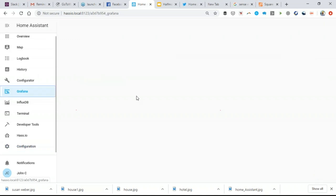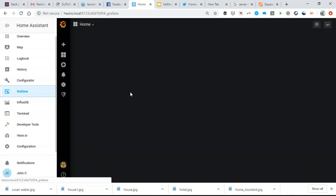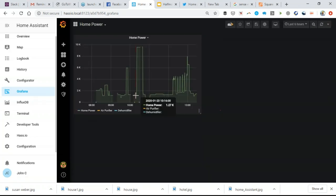And what that does is instead of having very spiky loads where all the loads come on at one time, which can be very hard on your batteries and very hard on your inverters, instead with enough devices on load leveling, it will smooth out. And what's nice about the way I do it is I go after the heaviest devices first. But you can start to push.